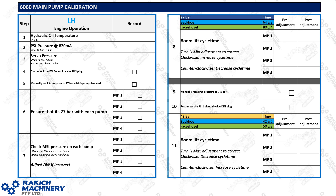Here we have the 6060 main pump calibration in a printable record sheet format. The blue box indicates the left-hand pumps. You can move through each step, entering your parameter or ticking boxes as you go through the stages. At step 8 at 27 bar, do your cycle times: record them in the first box, make your adjustments, and record them in the second. Then go to 42 bar and do the same. The right-hand pumps use the red boxes in the same format. You can print these out and carry out the tests with just these single pages.